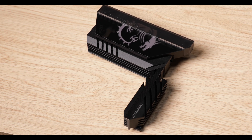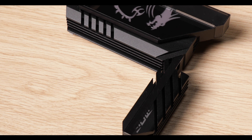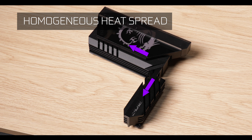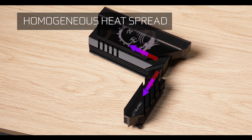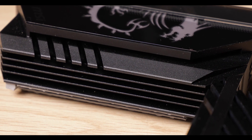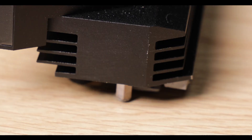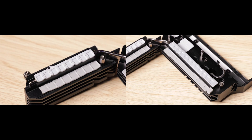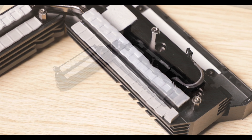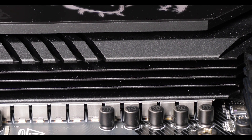As in any Carbon, the cooling blocks are a masterclass of what premium cooling blocks should be. We have a two-stage segment attached by an 8mm wide pipe for more homogeneous heat spread. They have several winglets around them to grab more air. Special note to the main block, which probably has the thickest uninterrupted block of aluminium I have ever seen on a board. I need to point out how good and moist and fresh the thermal pads are — both in direct contact with chokes and power stages alike, which is just grand in terms of thermal relief.